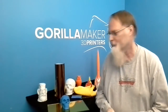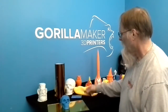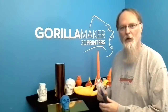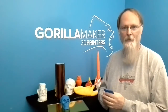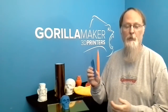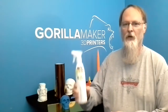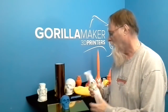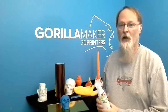To recap, there are only a few things you need. Make sure you have an adequate roll of Kapton tape that's wider than your surface. If you buy our Kapton tape kit, it comes with everything you need. You need an exacto knife — I prefer that over a small razor blade since I feel safer with a full blade and handle. You need a squeegee, either a dense foam one or something used for applying vinyl. You also need a cleanser — you can use regular off-the-shelf Windex. I use a product called My Cleanse. When I spray it on glass and use Kapton tape, it squeegees out cleanly, doesn't leave any residue, and I don't have any lifting problem with my tape.